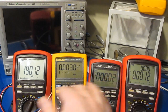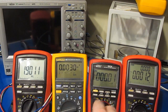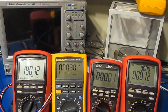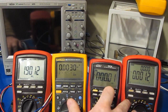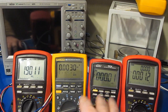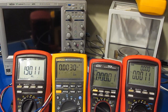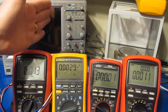So the third comment about the meter reading a little low, of course, that's what the VFD mode does. It's a filter. I think the breakpoint's set up at about 200 Hertz. Of course, a lot of those waveforms that we were injecting into the meters have very high harmonic content. So what ends up happening is if you looked at the waveforms that were somewhat clean, this meter was reading the same as the other meters we were using. But if it had a lot of distortion, this meter would read a little low. That's what it's supposed to do, is filter that out. The meter was just doing what I had programmed it to. Not a bug in the meter, it's just the way it works. So sorry for that confusion.